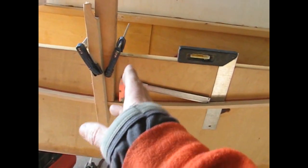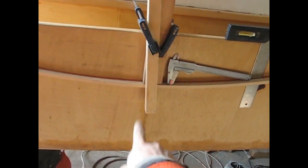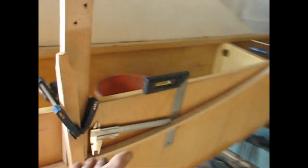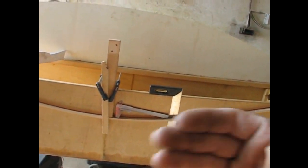I keep those battens and I use them for many years. Over here we're going about 12 down. I know there's 25 over here. The waterline is 20, so I go another 5 above the waterline where the knuckle will start. This will be coming out like this and then up like that. Now to make sure you've got a perfect curve — you've measured here, there, centers, right, left, symmetrically — but still the batten can play games on you, so you want reference lines.